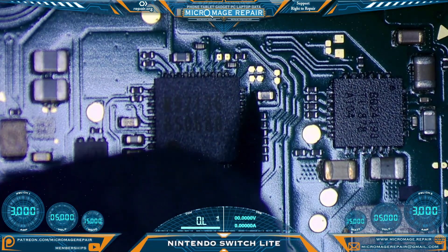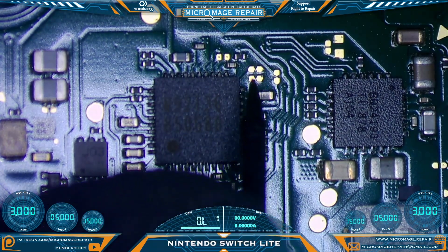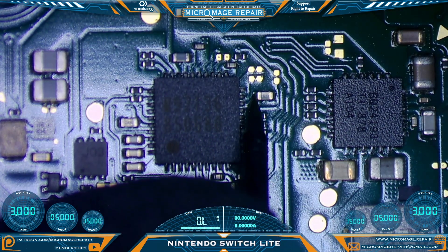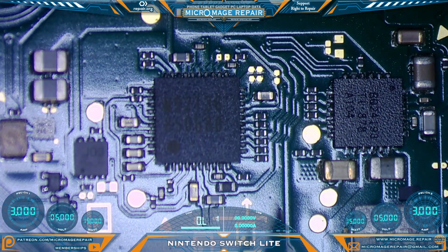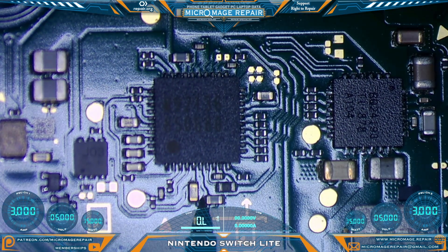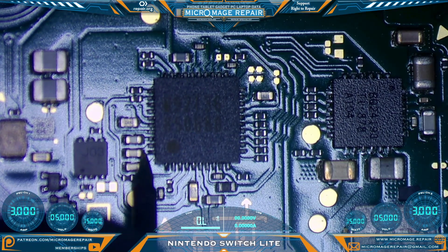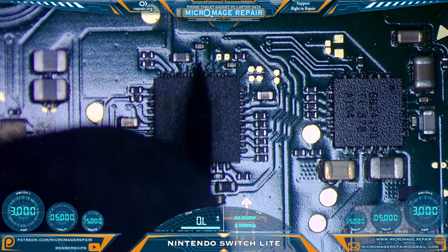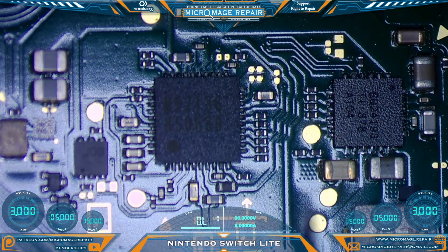We'll find ourselves a ground and test the capacitors that surround the chip. On capacitors, one side will always be ground. The side you do not want to have a pathway to ground is the line going to the chip. This capacitor right here has two lines going to the chip — in that case, one side will always be ground, but you do not want both sides to be ground. So far, so good.